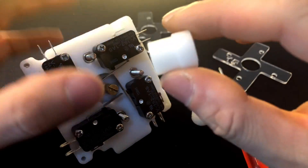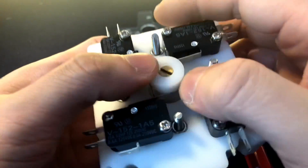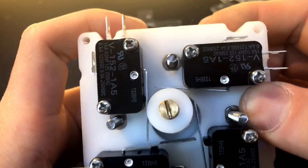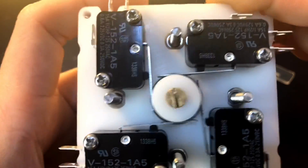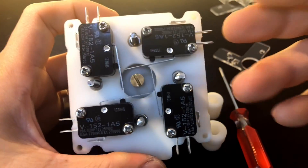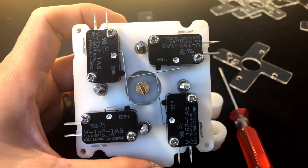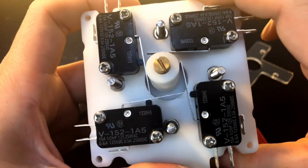Because if you use a big actuator — like this one at 16.5mm — you may risk bending the switch hinges or the switch plate. You can see that if I move it, you can bend the switch hinges and you don't want that. So you can experiment with which position and actuator size is suitable for you, but always double check when you reposition the switch or change the actuator. Make sure you don't bend the switch hinges.